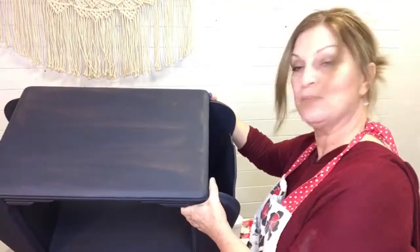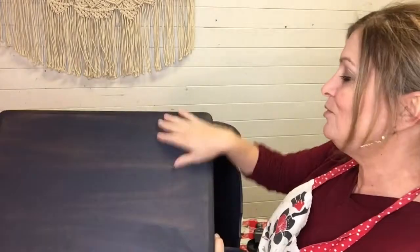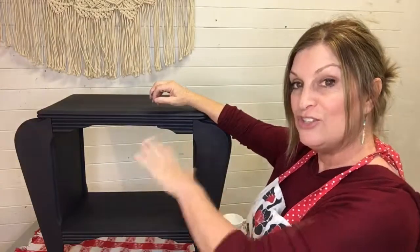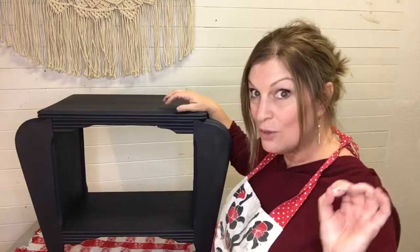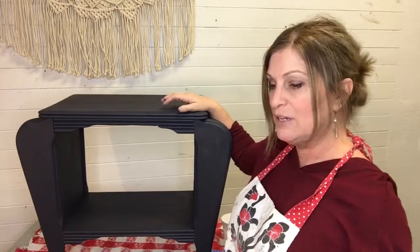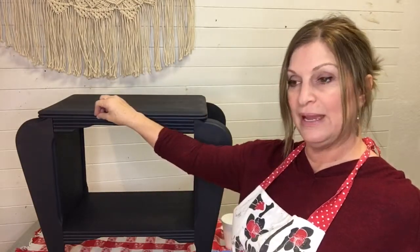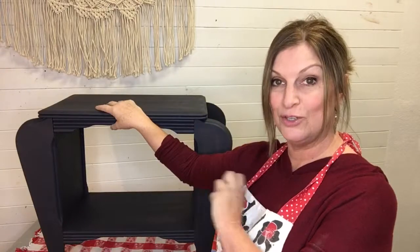What we see here reinforces my earlier point - it's not 100% coverage, and I wasn't expecting 100% coverage, so we always know we're going to do two coats. You can paint the second coat just as soon as the first one's dry. If you want zero distressing on your piece, give it at least two to three hours to dry solid, because putting more paint on - which will be diluted a little with water - can actually distress and remove some of the paint. The drier your paint is, the less likely distressing will happen when you put on subsequent coats.